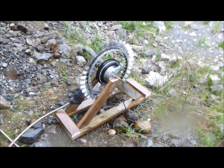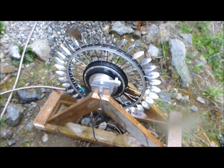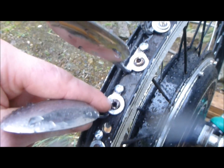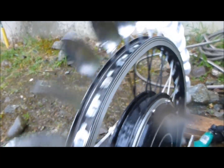We got the old water wheel running here. Here's the wheel of many spoons — definitely a pain to get them all fastened on. We used an e-bike hub, your standard bike hub, and fastened the spoons onto the exterior of the rim using the spokes and one self-tapping screw. These are all spoons picked up from a second-hand store — cut the stumps off and fastened them on there.